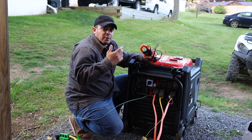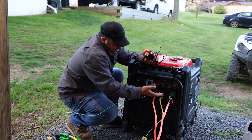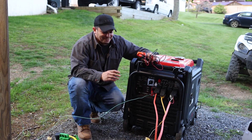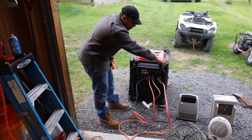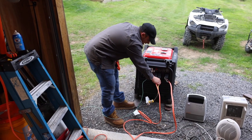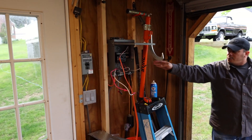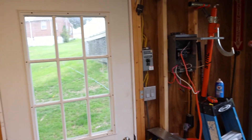The peak is probably just for a spike — it depends if you're running something with a constant consistent load. We're going to try to max that out today. I have some kilowatt meters so we can test that. We've got three portable heater units connected: two of the units are on the 30 amp at 120 service, one heater is on the 20 amp service, and then we have our 240 side running a heater through the load center, which has a 30 amp breaker for the heater and a 40 amp for the welder. That 240 heater runs right around 4,700 watts — it's a 5,000 watt rated unit.